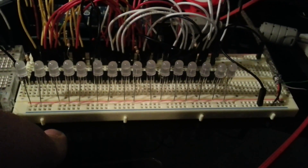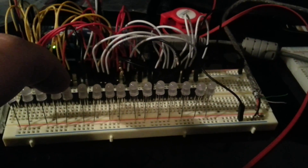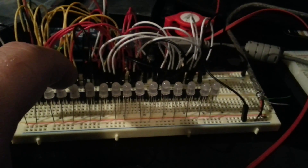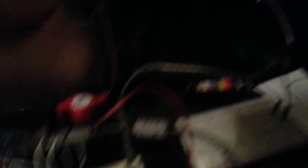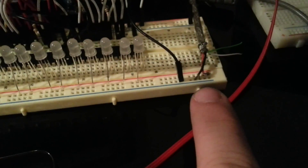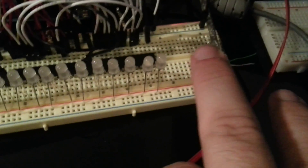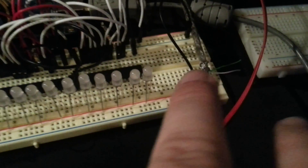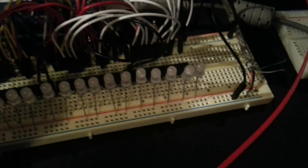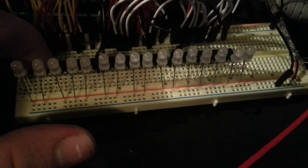A lot of schematics I've seen pull power straight from the 5 volts coming off the Arduino, using the onboard power regulator. I found I was very close to the maximum range on the Arduino. Rather than chance it, all I did was run a USB cord back to a cell phone charger — you can't really see it back there. I just snipped the end off; it's 5 volts right in, exactly what everything else uses. Then you just tie the ground from your USB cord into the common ground, because the ground coming out of here is going back into that side.